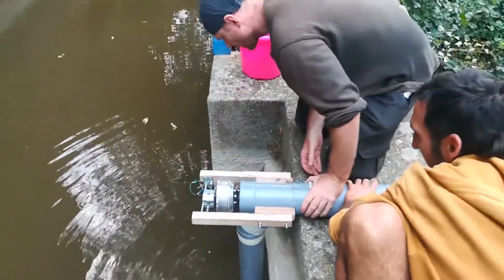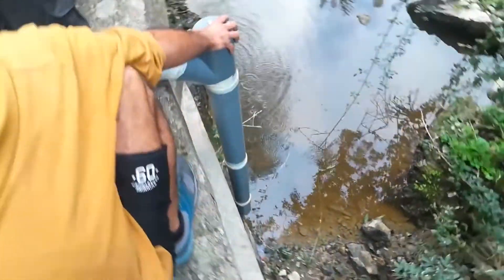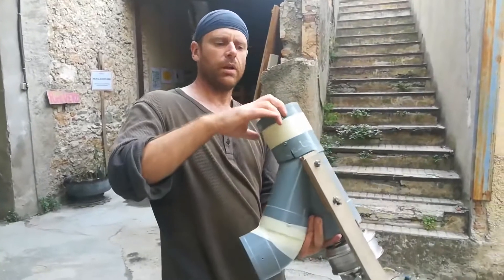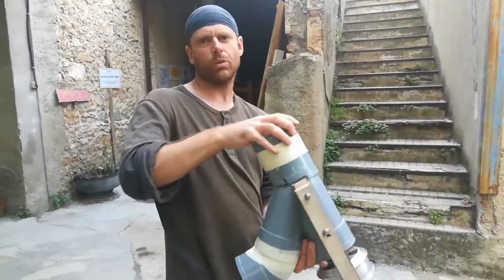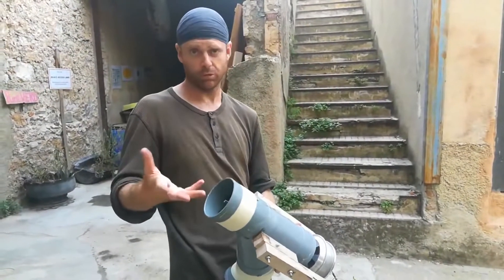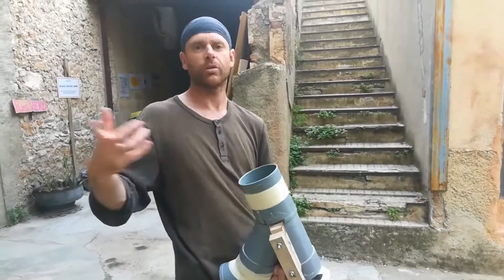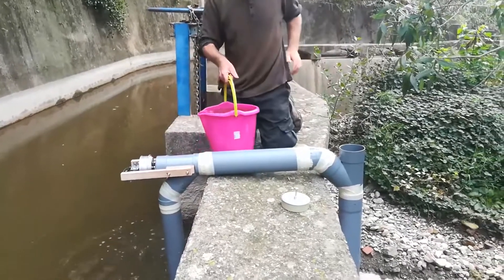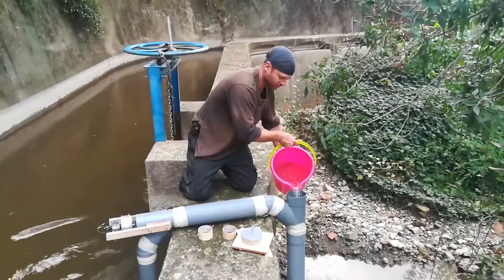We're going with the unreinforced PCU fan because it did the best revs. The 3D printed impeller did a good job — it did more torque with less revs — but I want more revs, because that means more voltage, which means less transmission losses. I want more revs with more torque.